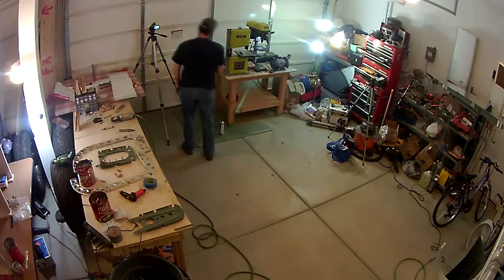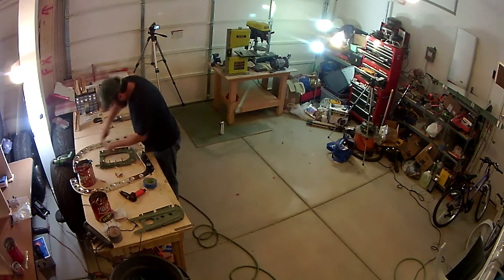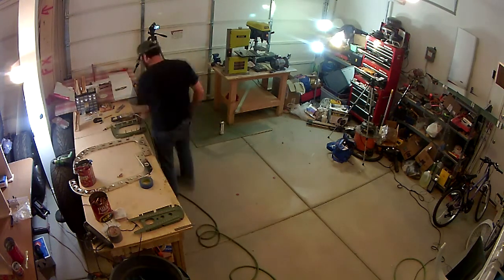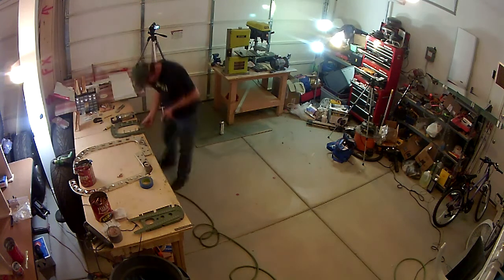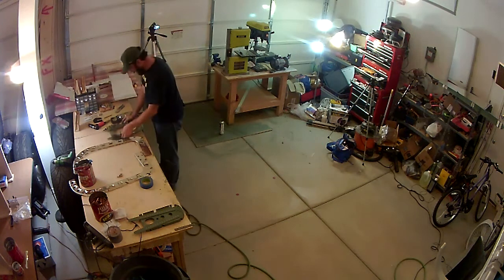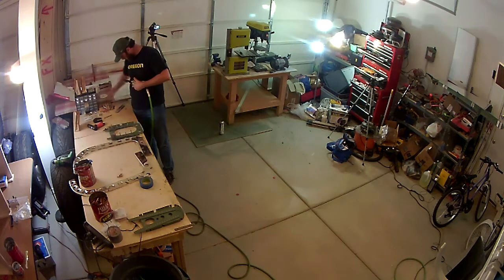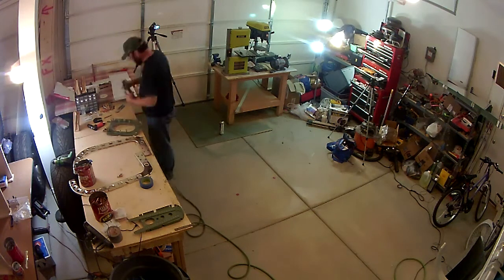It's so much easier. So anyway, now I'm going on to some of the other bulkheads. You see the big giant bulkhead there, the ring that's currently unpainted. You put all these together, and then eventually you will get the frame that you've already constructed to this point, the battery box frame and whatnot, and then the bottom skin, and then you'll put it all upside down and you'll cleco and then rivet it all into place.